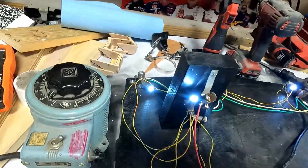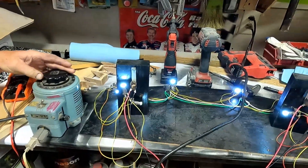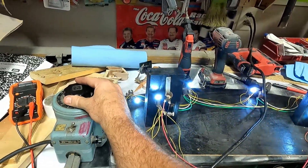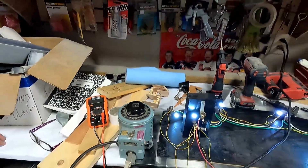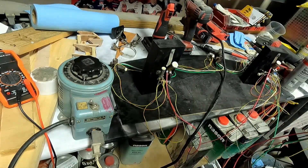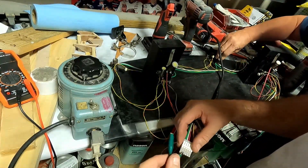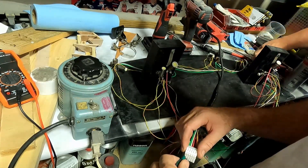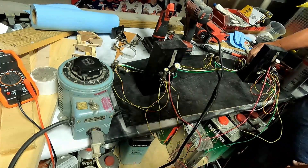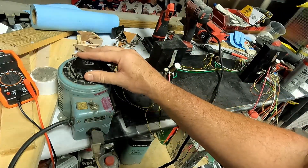Now we'll test the flashers. I've got the transformer — just got that plugged in with a couple of alligator clips. This is my little mini transformer that you can set to however many volts AC you want. As he's turning it down you can see — I'm only up to five volts there. I hooked up the harness — you can see the white and green wires, those go to all the flashers. We're going to hook on there with the white and green, and put it up to about 10 to 12 volts and put some flashers in.